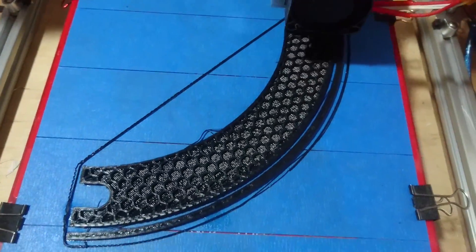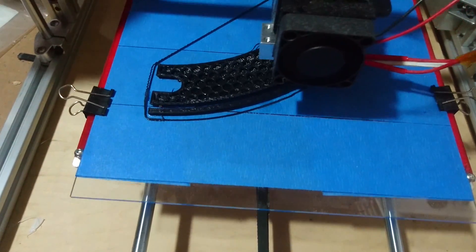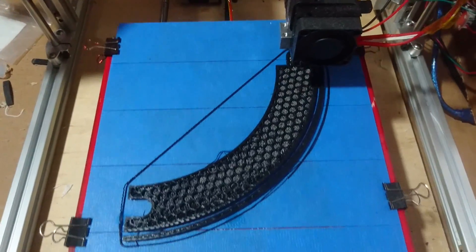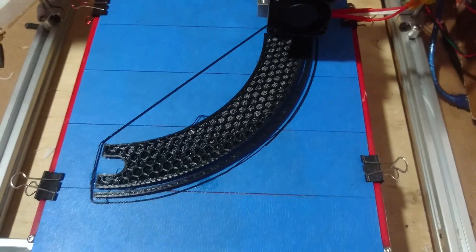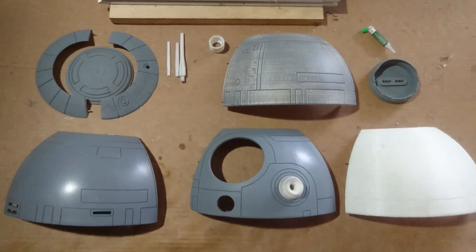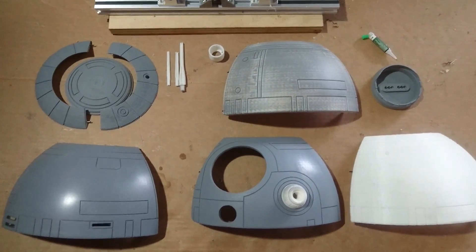I'm trying out the ABS plastic — these dome parts are PLA. Unfortunately, the ABS is a little bit strange in that it likes to curl up at the ends when you print it. I tried doing a cardboard barrier to a certain degree, considering I'm out at the shop and it is kind of cold out here. I did use some hot glue to glue the ends down, so that helped a little bit, but we'll see how this print turns out — should be about an hour or so. Continue to watch my build on this guys. I'll be doing a lot more with this. Like, subscribe, share as always — do your thing. Thanks for watching.